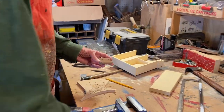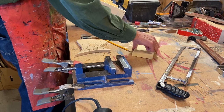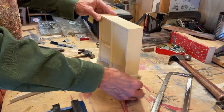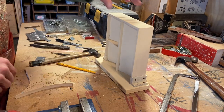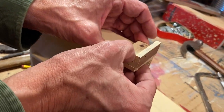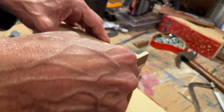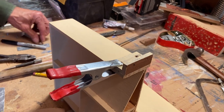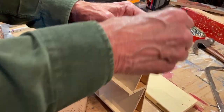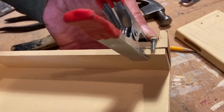Now that's ready to go. I'm going to use another one that's already been pre-painted and pre-drilled. I often use a clamp, like an extra hand, to hold it in place. I'm going to use a number six screw to go in the sides — the only reason I'm using that is because it's short enough to go through both of them, but not all the way through to the other side.